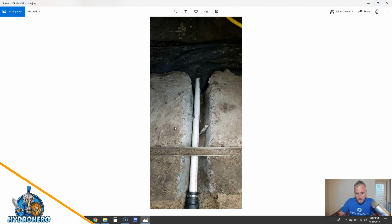One of the other things as a do-it-yourselfer you're going to want to think about is your crawlspace access well. A lot of people put covers on top of them, and the water comes right through the access well and floods out their crawl space, and they can't figure out why. They think it's because they don't have a good seal or lid on top of their crawl space access, when it's the actual hydrostatic pressure rising from the ground up, and then it goes over and into the crawl space.